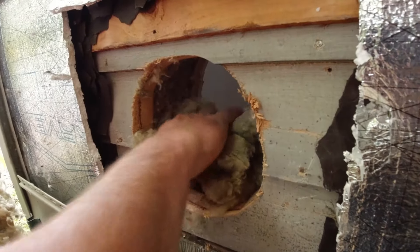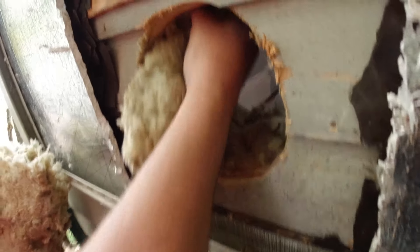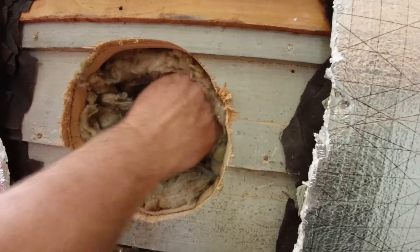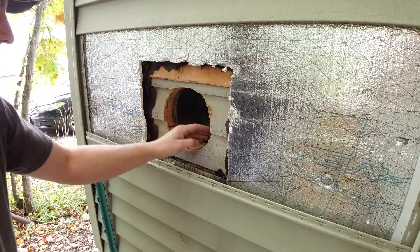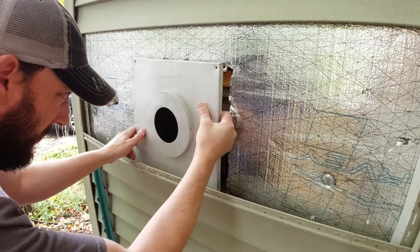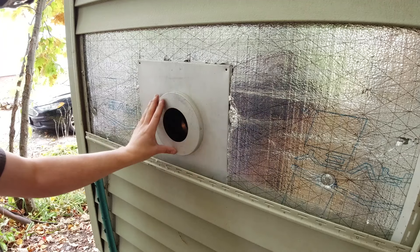Here's our hole and Doug's just gonna take some — it's called mineral wool — which is a fireproofing material. Just to be safe. The sleeve that you use is supposedly good enough but just as a little extra, we're gonna put this fireproofing in here before we put the sleeve in. Okay. Put this piece in. There we go. That's good. Now I'm gonna leave this loose so we have some play with that pipe on the inside.